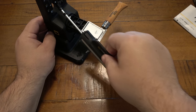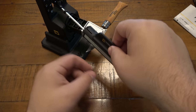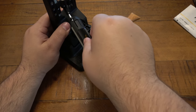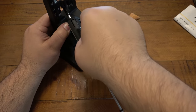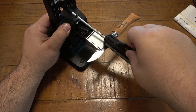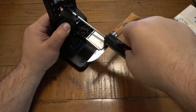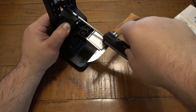If this is set all the way down while sharpening I could go off the stone — not a huge deal going off, but coming back up it's going to jam into the edge. So I want to push this little rubber piece up to there; that's as far as I want it to travel. That just ensures I'm not going to accidentally run off the edge. I'm lifting and dragging down — you could go up as well, especially if you're first starting, but I just use this same technique. I'm more of a hands-on type; if I have problems I'll revisit the instructions.